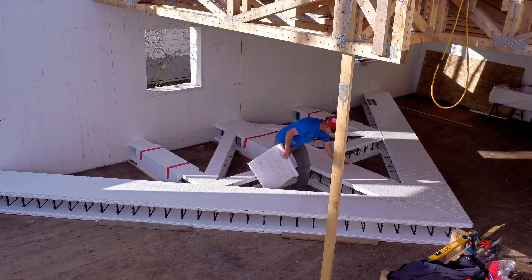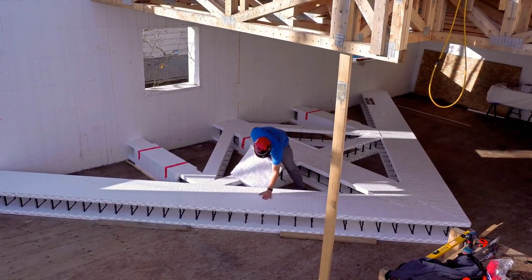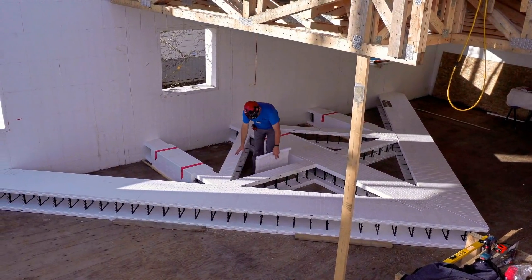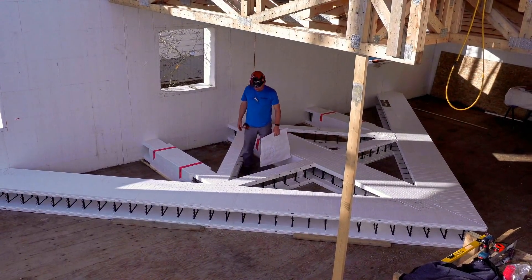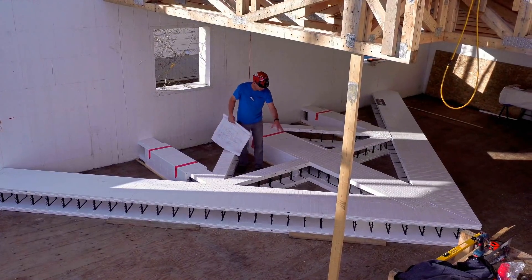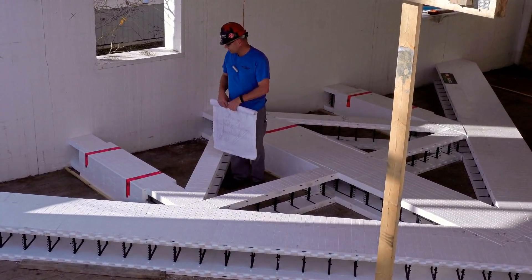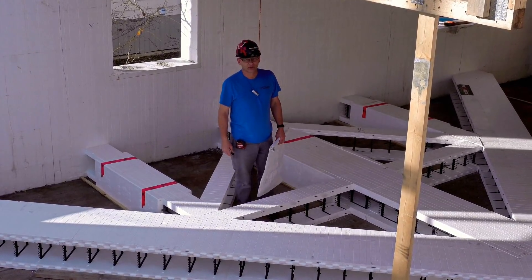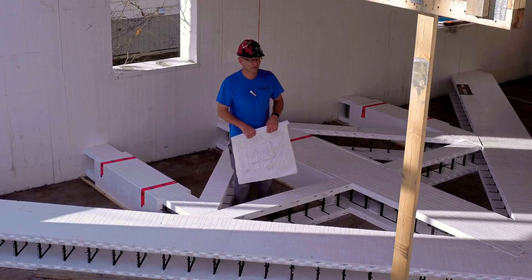So we're going to put this backbone up first, then these 24-inch beams in, then we'll put these support columns in, and then these little fancy 8-inch angle pieces. These four windows are exactly the same size, and then they've got these bigger windows at the bottom. It'll be a very easy job to do. And then we fill it full of concrete - that's going to be fun.